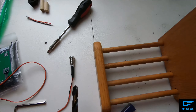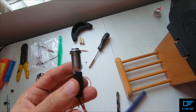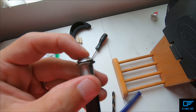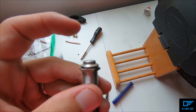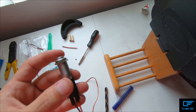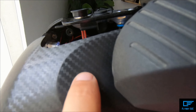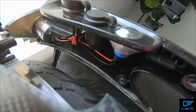Thinking if there's an interference fit, I can just thread it in. This guy's also really long — I feel like it doesn't need to be that long, but this is the one that was recommended to me, so I bought it like months ago. This is a latch switch. When you press it, it stays down, and when you push it again you release it. I didn't want to have to hold my thumb down when I wanted to cut off the power to the motor, so I wanted a switch that would stay on. The seat sits roughly right there, so I was planning on putting the switch right here in this area. There's plenty of space — I don't think it'll interfere with any of the hardware, but I should double check that before I drill my hole.